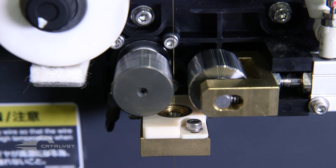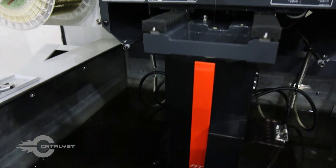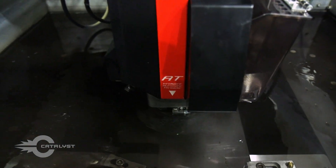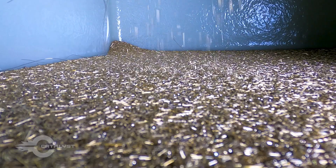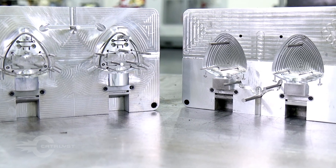In the case of wire EDM, the cuts must pass entirely through the material. This brass EDM wire resembles a thin guitar string; it's fed from spools top to bottom, but after a single pass the wire has to be recycled. EDM is capable of deep, accurate cuts, which are essential in producing a quality mold.